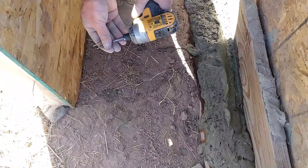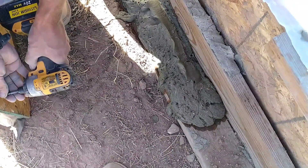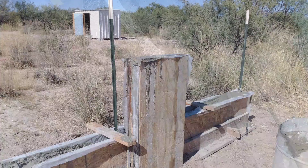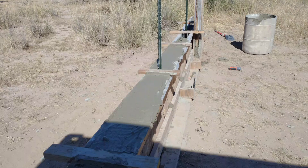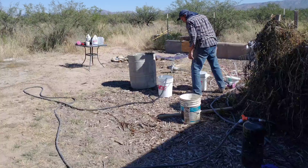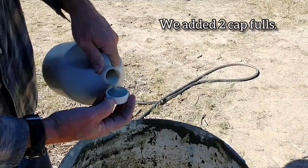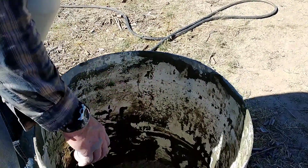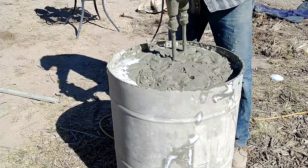One thing we learned about pouring a taller section of aircrete is that a tall column creates pressure at the bottom, and that higher pressure makes it try really hard to get out of the form. It's much more difficult to seal a tall form than a short form. For the next batch we'll be adding a thickening agent, which is supposed to make the aircrete stronger and allow deeper pours without the air bubbles breaking down. Here we are mixing that batch with the new mixer, still trying to get the hang of the technique.